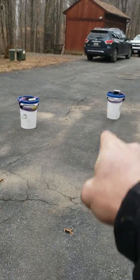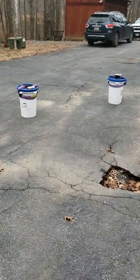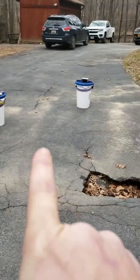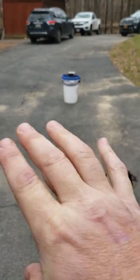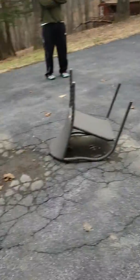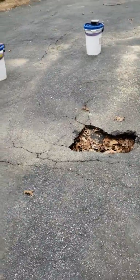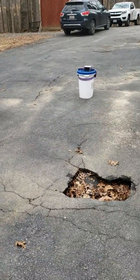We'll see how it looks going that way because we're not going to know until we open up the asphalt and get into the dirt. It looks pretty bad — there's a little dip and the crack runs all the way there. So 45 feet of pipe, two and a half feet deep, filling in a whole bunch of extra holes, taking out some asphalt, putting new asphalt back, and backfilling with crusher run.